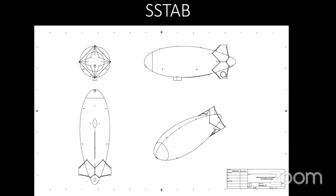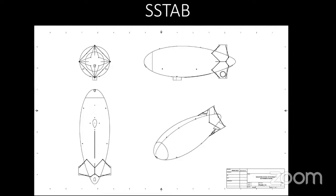So how to find endurance? Because in aircraft case, we have a formula. How to find what? Endurance. So in case of airship also we have a formula, but it's very simple. You just have to calculate how much is the battery consumed, and from the battery capacity you get endurance automatically. So if you know the current which is being consumed, this calculation we will do tomorrow.